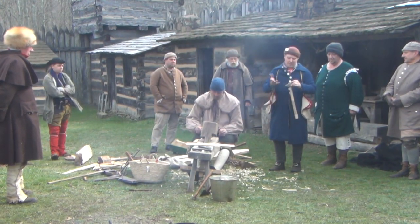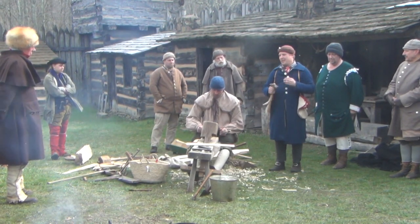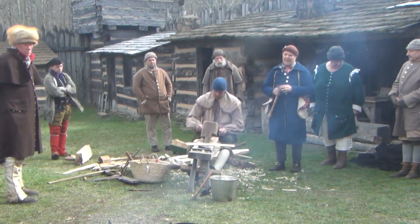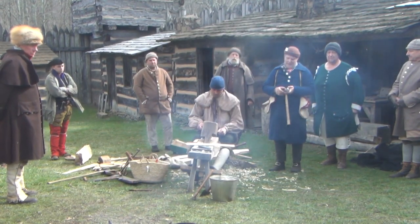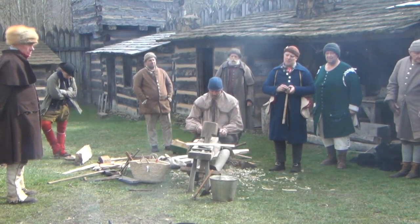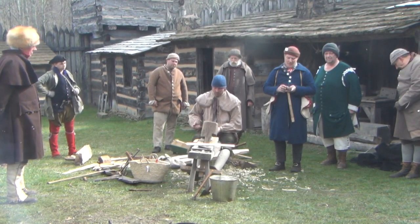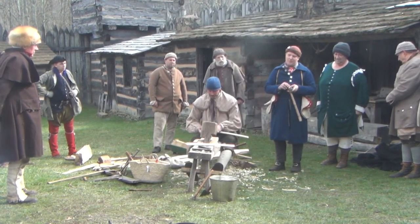But typically your wedge needs to be a softer wood than what you're using for your handle. Anybody heard or done different than that? Well, we've got to ask that question, what the preference of wedge material would be. I use poplar because we have a lot of it. You want that softer than your handle wood. Right. And I thought it would be the opposite. You wanted a hard wood for your wedge so it doesn't compress and drive the handle apart. I don't know, I'm just guessing. Yeah, I don't either. I've had good luck with softer stuff.